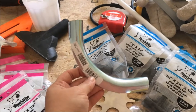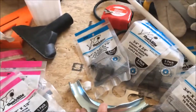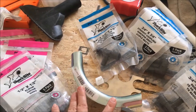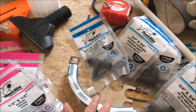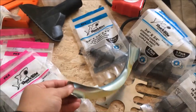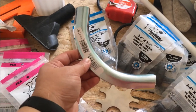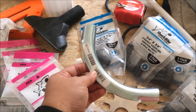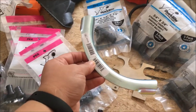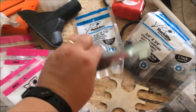You have a couple kinds of supports that will take your pipe and bend it to a 90-degree angle and hold it there. PEX is flexible, but the three-quarter inch is pretty difficult to bend — it took bracing the pipe against a stud, full body weight, and two of us to pop one of these into these steel elbows. Using these means you didn't have to use elbow fittings to change the direction of your pipe, and fewer fittings means fewer chances for leaks. My original intention was to use quite a few of these, but since I work by myself quite a bit, I just did not have the strength to do these big ones.